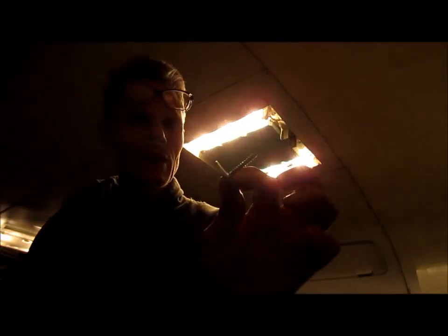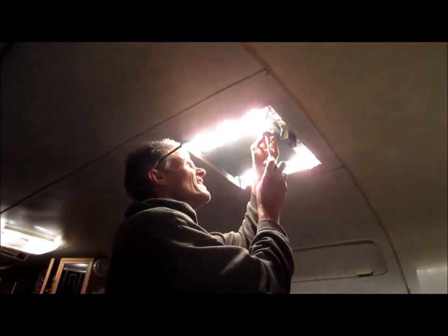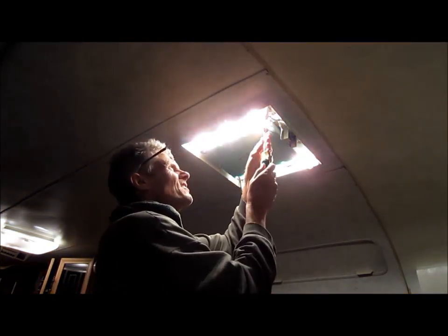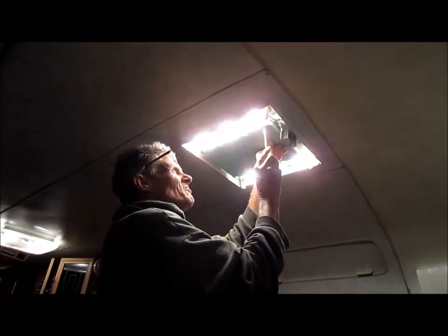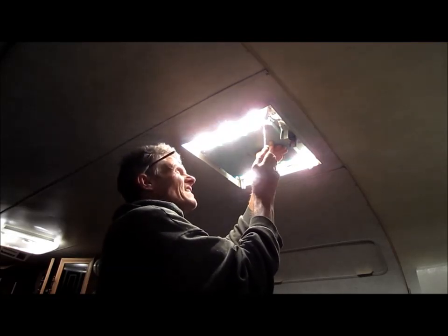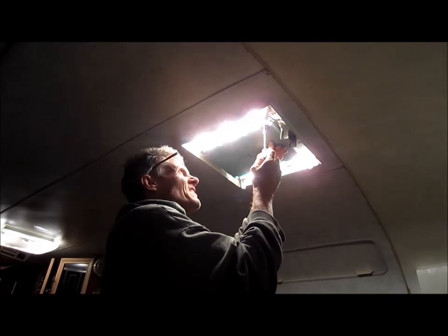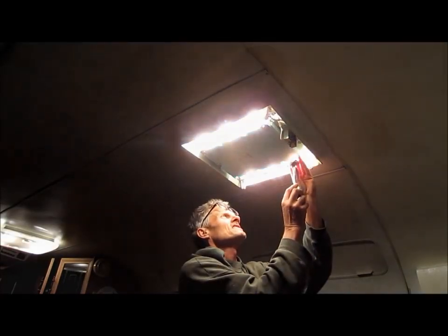You have to put big, fat fender washers under these screws because this foam, as you probably know, is just like feathers. It's so light and bendable. And these are 1¼-inch screws, and they need to suck that foam in a little bit to get in deep enough to these holes. But they're going to be just right with just a little bit of sucking.